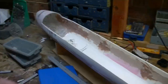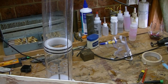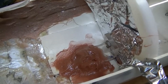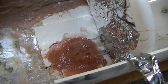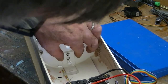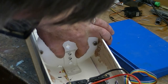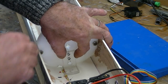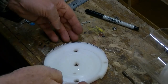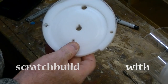I will attach what I need to to the other end of the cylinder to hold that in place. I'm going to push this in, it's going to lock in, and then I'll screw down the other end. Looks a bit messy but so does other parts of this hull — this is going to be fine. Same thing here, just drilled a couple of holes, marked those out, I'm going to tap those in so that the part that's going to connect goes straight down through into the bottom. What I'm doing now is just fine-adjusting, cutting it back on the grinder so that the top will fit properly.